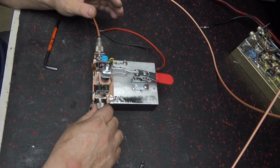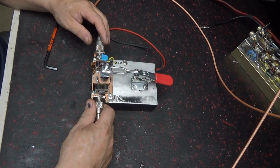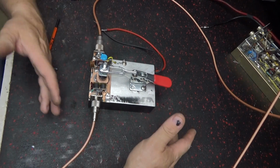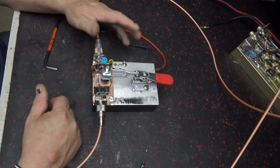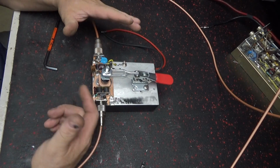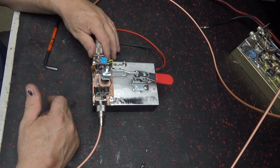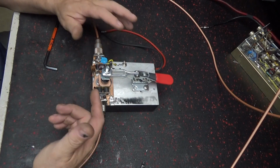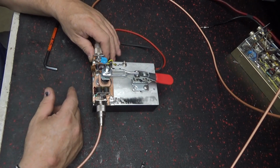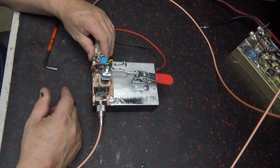Like I said, you could run a watt meter and a dummy load off down here, a little cheap meter. So many different ways you could do it, and run a signal through it here and see what you get. And you can match transistors. I really wouldn't want to do that because HFE knocks down as soon as you key some of it. So that's up to you.